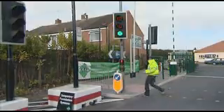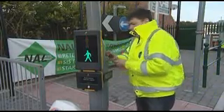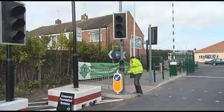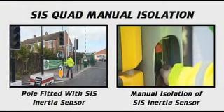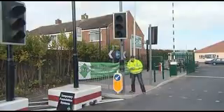The SIS quad enables you to electrically isolate an individual traffic signal pole while all others remain operational as normal. This has proved invaluable for maintenance work on large junctions. The maintenance engineer simply locates the SIS inertia sensor in the pole he intends to work on and disconnects it, leaving the individual pole free and hence safe to work on.